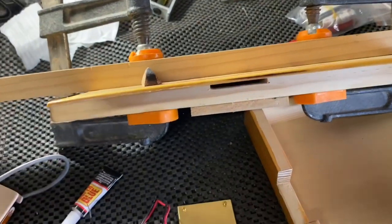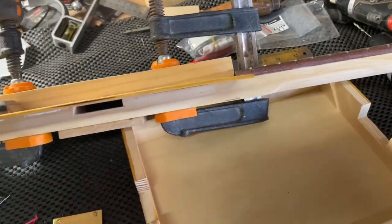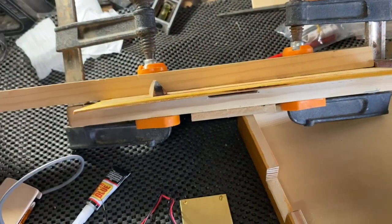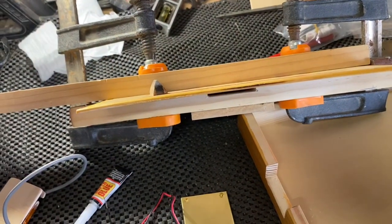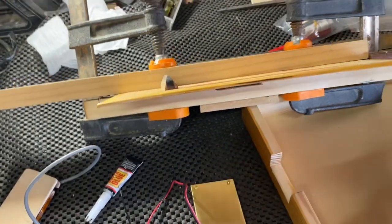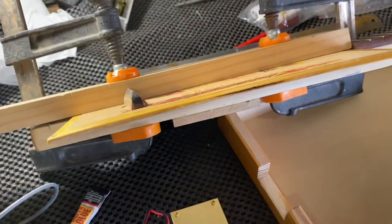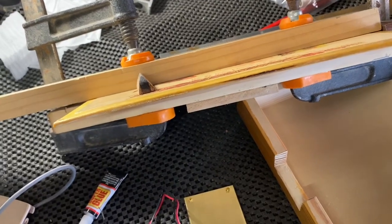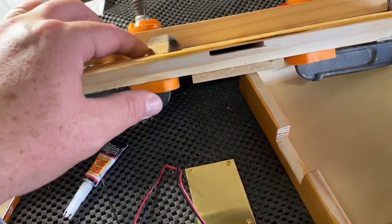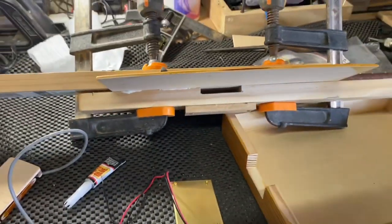Earthing is different to 60-cycle hum, which is something you get with a single coil pickup. What'll happen without earthing is you will get a buzz — it's more of a buzz than a hum. When you touch the strings, the buzz goes away; take your hand away, the buzz comes back. Touch any metal component attached to the strings, like the machine heads, the buzz will go away. If that happens, you've got an earthing problem, and that's really annoying. If you're building a cigar box guitar for someone who's going to use it on stage or wants to record with it, you're going to have to get rid of that. So please make sure you earth it, and I'll do another video showing how to do that.